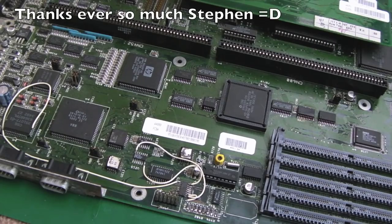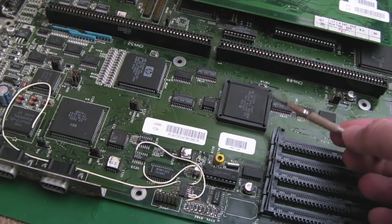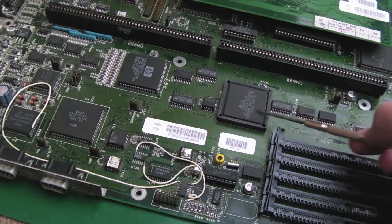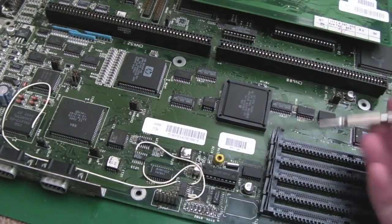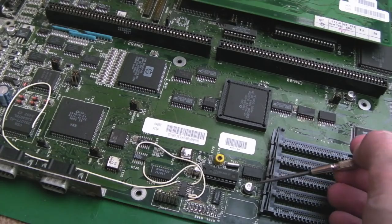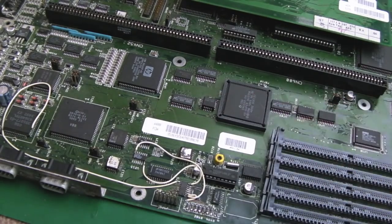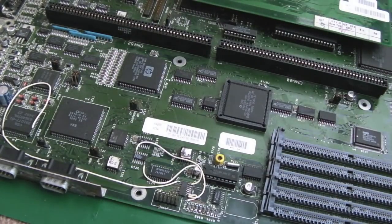So this is an Amiga 4000 motherboard. Should look familiar if you've been watching the series I did on Cather's Amiga 4000. It's the same revision board here. It's got the Super Buster socketed again. You can see some wire mods and things have been done to this, and look, the chip here is missing. All the pads have gone with it. Yeah, caps have leaked, that's clear to me. Although the ones on the audio circuit up there, I'll show you in a minute, they look alright actually.